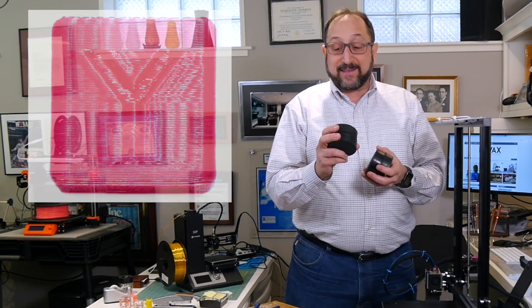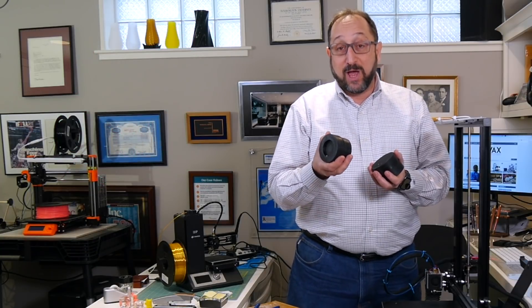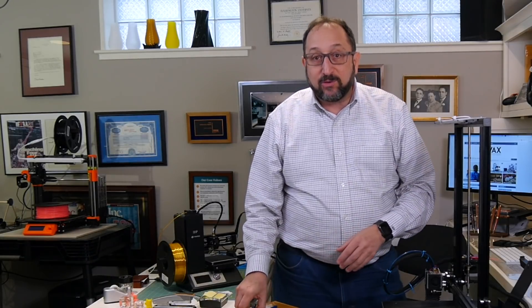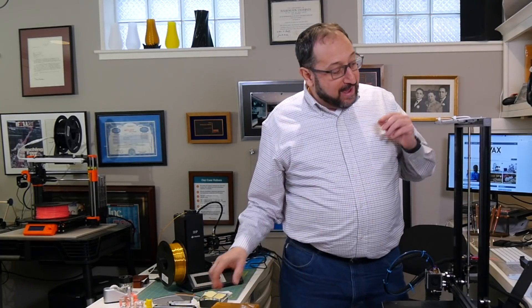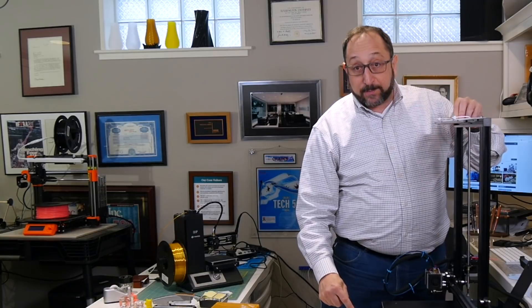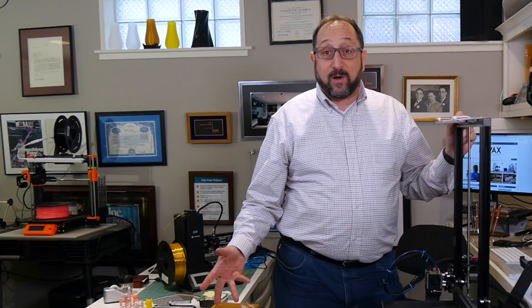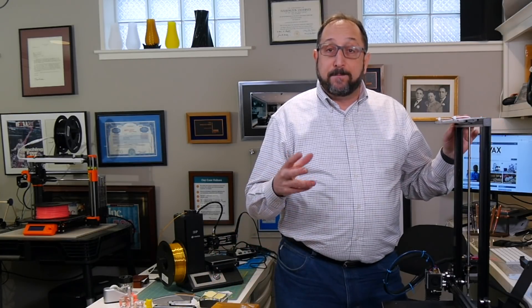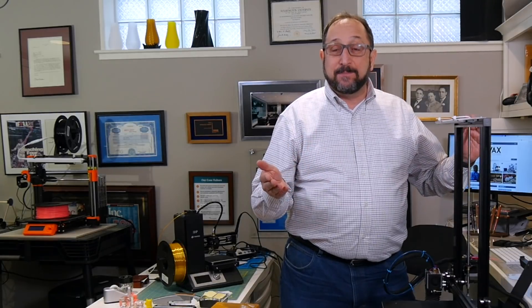I've attempted to solve that problem in a very simple way. I bought a bunch of anti-vibration pads that they make for washers and dryers and put it under the printer — didn't make a difference. So I'm going to do something a little bit more radical: Creality makes a CR10 kit that adds reinforcing beams between the corners of the printer. I'm going to assemble those onto this printer and then do some more test prints.